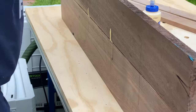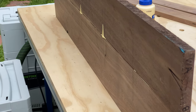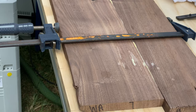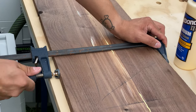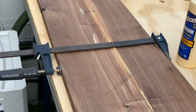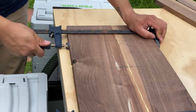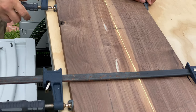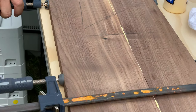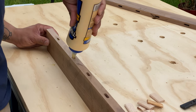Clean as much as you can of those drips of glue right away — it will be a lot easier the next time when you go to remove it. There will always be a little bit to scrape off, but if you wipe it with a wet rag it will be much easier and less work later on. Here we're using clamps to hold the wood together, and we'll wait at least an hour.